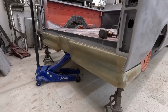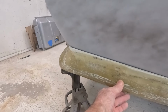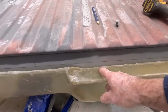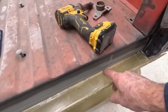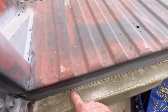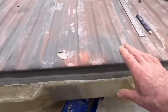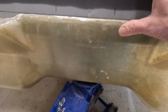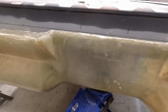All right, there is the back one stuck up there. Doesn't fit too bad. Get that up there. But I gotta trim it along this front edge here that hits the bed. You see it's way out here. So I gotta take off about a quarter. So I'll take off where it's hitting here first, and it's hitting over here. Get those trimmed in and then bring the whole thing in. This should go tight enough that where the license plate is will sit flat up against the back of the bed. So a little bit of trimming on this and we can get this one stuck up there.